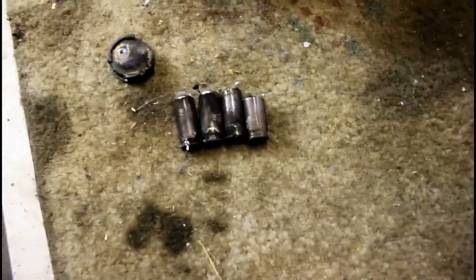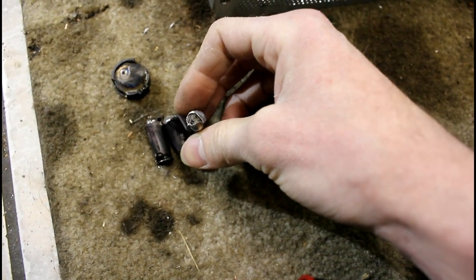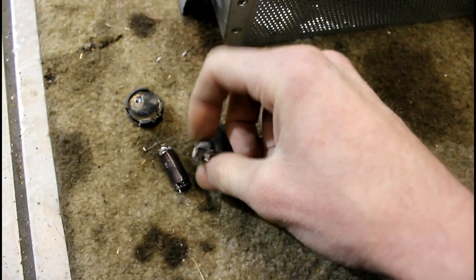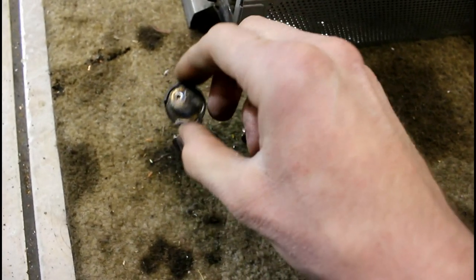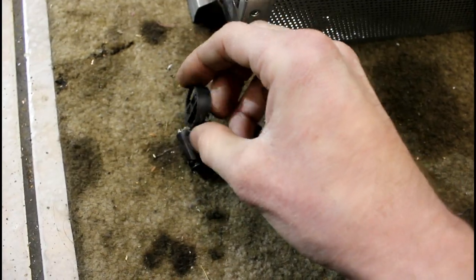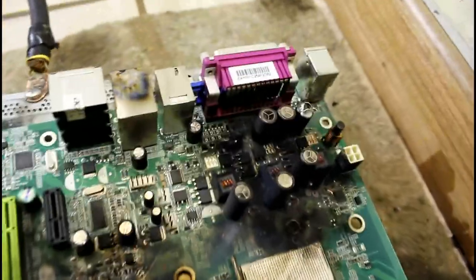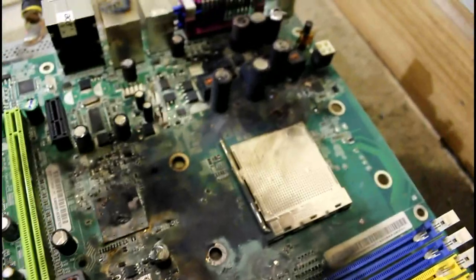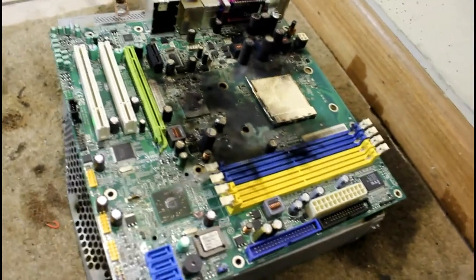These capacitors here were actually dislodged during the explosion. You can see the top split open there, and you can see how the capacitor is actually rolled — the two conducting foils and the insulating layer between them — and they all ruptured at their rupture point. All the capacitors that don't have vents are weakened at the top so they can rupture. I actually took out the lithium battery too — it flew off. There are a few more capacitors on the board that split but didn't fly off, but the die on the chipset actually flew off.